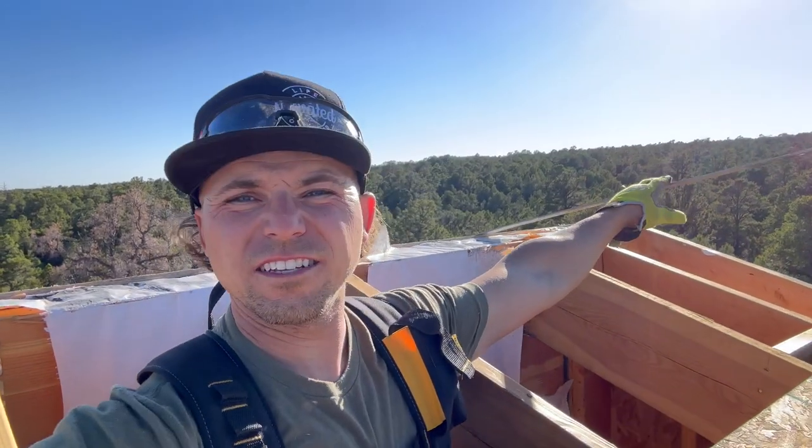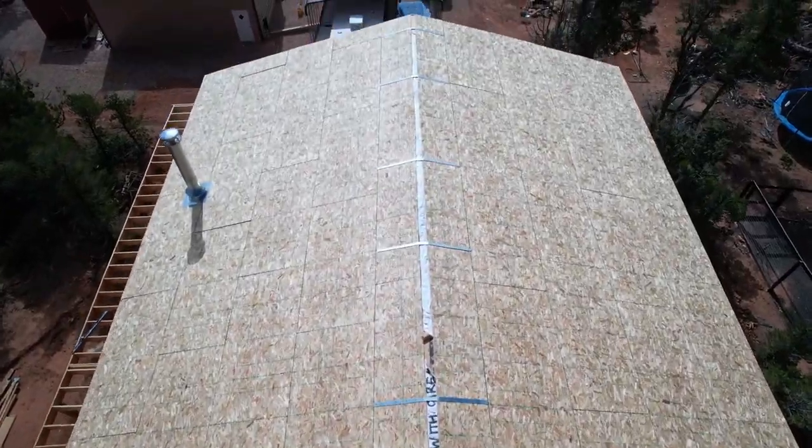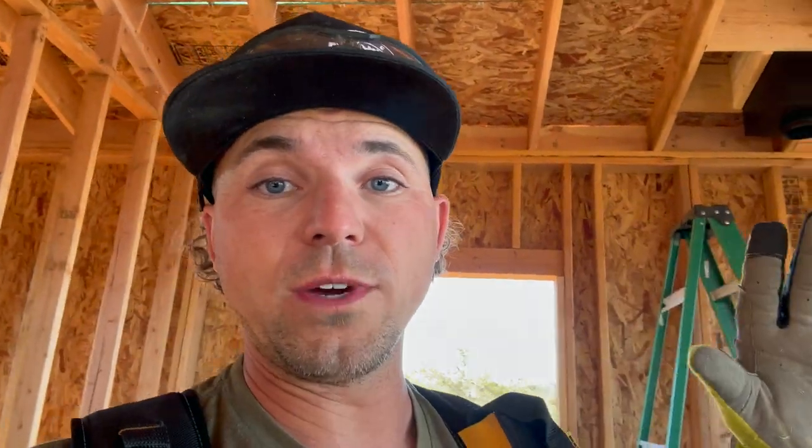It's kind of windy but I can finish this last roof strap once the OSB is down. I just got done finishing the roof strapping — I cut the OSB back from where it was going over the peak so it's right at the edge of the glue lam, leaving a little gap for airflow. Other than putting ice and water shield and some underlayment down, that roof is ready for metal. For soffit venting, I'm going to use a hole saw to cut two or three holes in each block between every rafter, put mesh on the outside stapled on to keep out bugs and birds, and that will keep moisture, mildew, and mold out of the roof space.